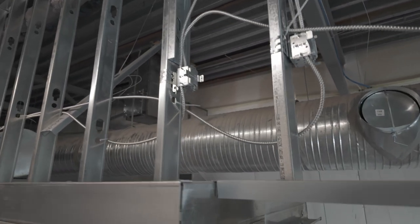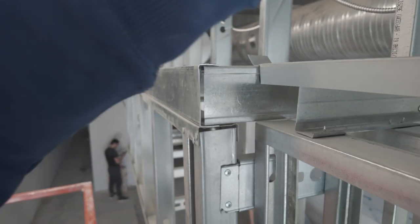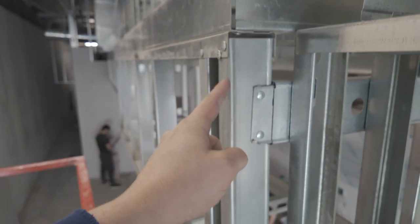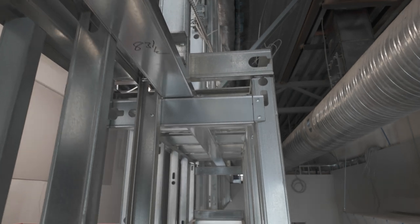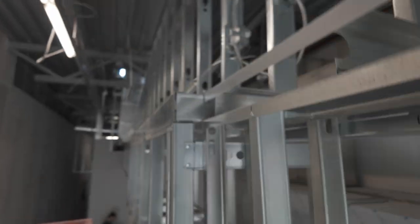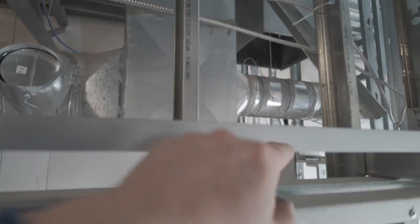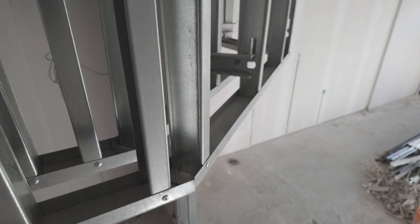On the other side it's the same thing - just like a soffit. I'm squaring it across, checking elevation, shooting this way as well, and pin lasering up my corners so they're all lined up. This one here is simple - it's a four-inch return. It comes four inches this way and underneath, and it sticks out a little bit behind. At the end you're capping it with the 3-5/8" at the top - capping it with your angle, your 1-1/4" by 1-1/2" angle. These corners I'm just pin lasering up so I do this side.